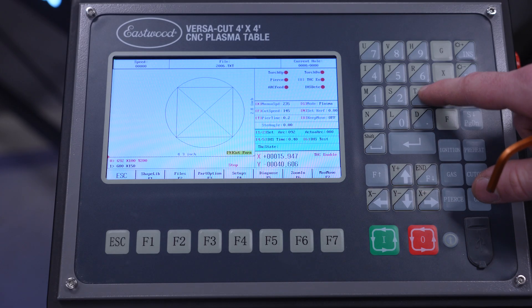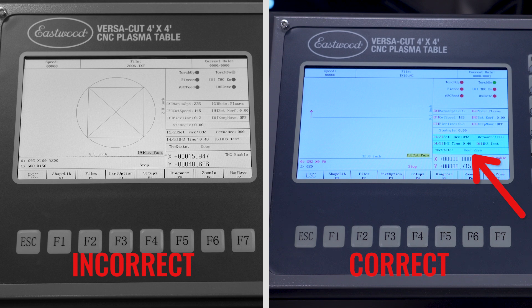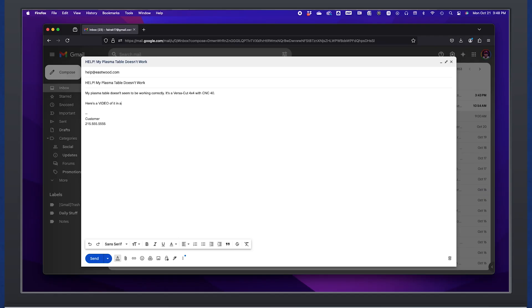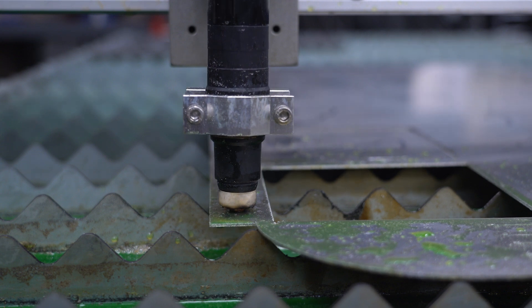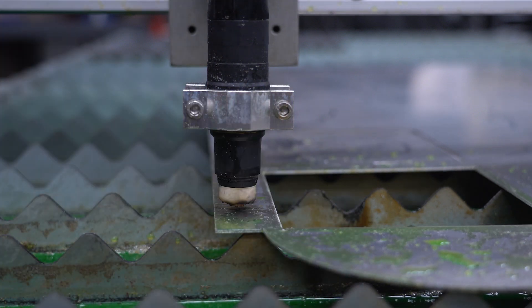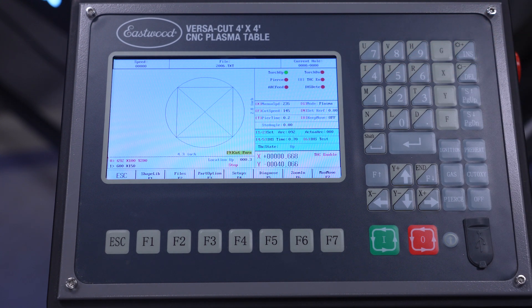If it wasn't any of those issues, check the indicators on the screen. If the computer is sending the signal for torch down but it's not going down, or it goes down and never registers zero, reach out to our customer service center. Including a short video showing your setup and problem will expedite the process. Note that thin sheet metal can have a lot of spring to it, making it tricky to set the initial height. As you take material out of the sheet and get thin sections, the torch could end up dragging on the plate. Watch how the part cuts the first time and position it to be fully supported by the slats. Bump the IHS time up if you see it starting low — it's better to fail an arc start than to drag and ruin a part.